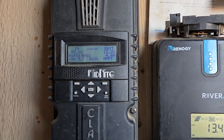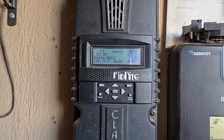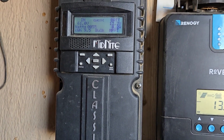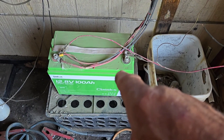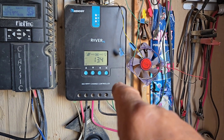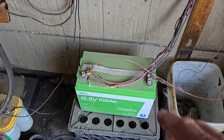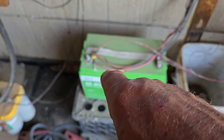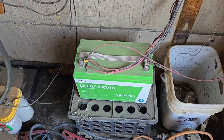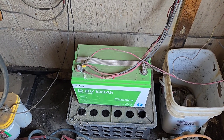Yes, I need an all-in-one here and an 8K would be exactly what I want. With the 8K I won't need any of this other stuff. I do have one battery running on a Rover charge controller — that's designed for LiFePO4 and it maintains that battery perfectly. All that one 12.8-volt 100-amp-hour battery does is run lighting in the cabin, and they're all LED lights.